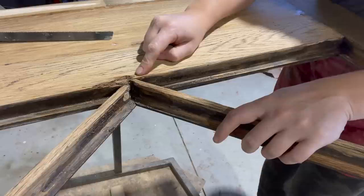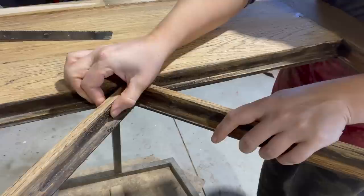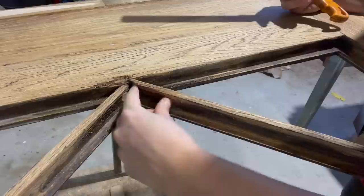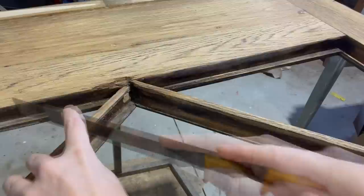Okay, so I've got this whole piece glued on at the bottom here. Now I have to deal with these two guys and this. So I'm just gonna cut back to about here where the rot stops. Even though I've used the hardener on all this, I wanna replace this top area of wood, kind of veneer it on top because it's missing down here. And then this one as well, just not as far up, but pretty much. So I'm just gonna make a cut straight across. Go about that far down. And then same thing on the other side.